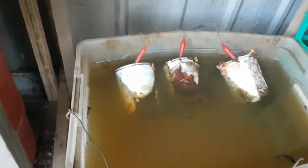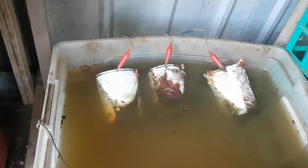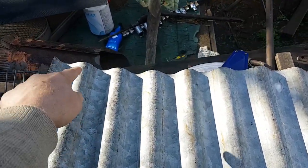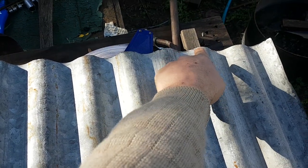In this video I'm going to show you a refinement I've made to my electrolysis bath. For ages I've been using these tins, but we're no longer getting those tins anymore so I need to find something else. Offcuts of sheet metal are really commonplace and easy to get. If I cut this so it fits into the tub and attach electrodes at the top, as it rusts away it can just sink down into the mix. It also gives a really good surface area, which is one of the important things with electrolysis.